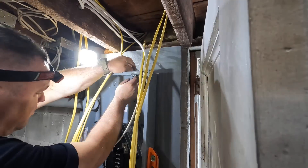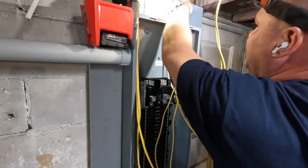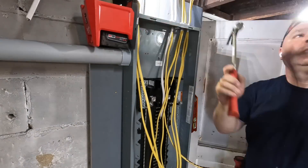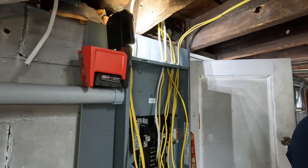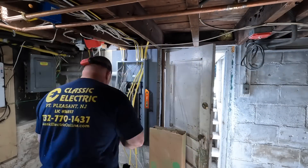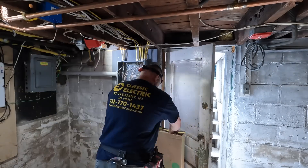My next order of business for this day was to get the rest of the circuits inside the new panel. Most are 20-amp yellow-cable circuits from the kitchen — there are maybe five or six different circuits: two small appliance circuits as required, a microwave circuit, a dishwasher circuit, a circuit just for the exhaust fan, and a couple of GFCI dedicated circuits for each of the two bathrooms, plus a couple of lighting circuits. Everything in here will need arc fault circuit breakers, but we're not energizing this panel for at least another couple of weeks. We're trying to wrap this job up before Memorial Day so the owner can have his house back.